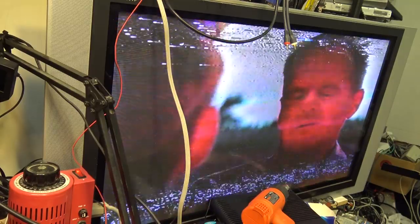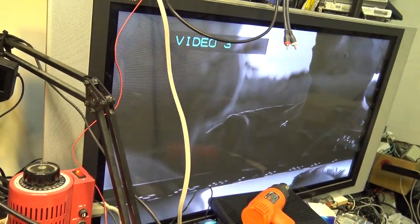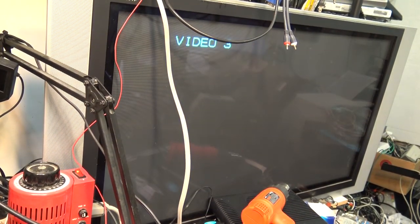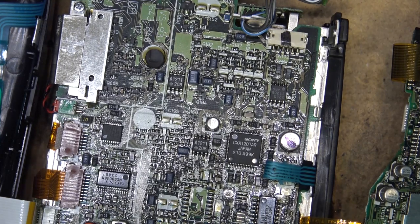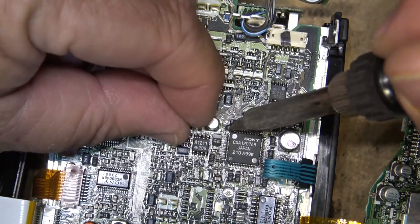So I'm putting it in freeze frame to get a picture. Watch the levels change when I bridge this one here. See that? So if I unpause it and bridge this one — I have a picture that's almost normal. Let's just change that one and put the right value in — that one's bad for sure. It's a 47 microfarad. I don't have a surface mount to put in there, but I can probably put a regular one in. They're all probably bad, but this is the one causing the biggest problem right here.